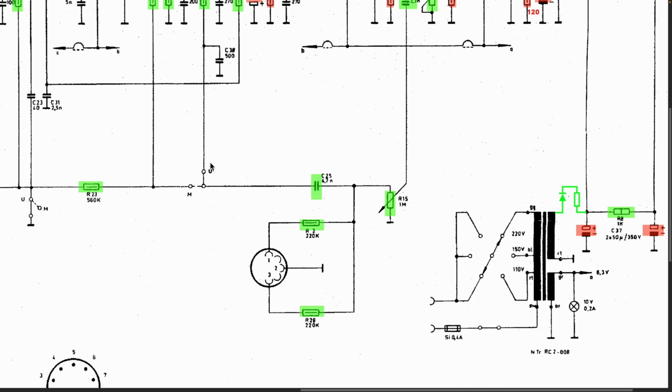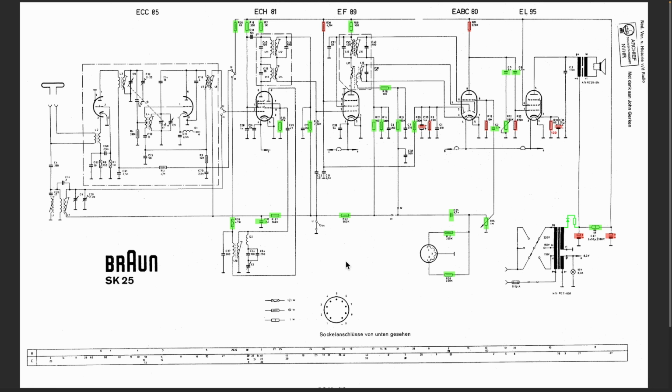Even if it was a question of silencing the FM, silencing the medium wave, and just allowing the phono to go through. Obviously, this is permanently connected. If you put a phono signal in here, and you put it to FM or medium wave, both signals will come through, depending on the relative strength of the phono. It could play over the radio signal, but if it is very weak, the radio will swamp it. So it's efficient, but a little bit lazy. I'll have to try that when I'm thinking of putting Bluetooth on this, which is a challenge because this is very, very small. So we're back to the deaf AM band. I'll have to do some more thinking and let you know.